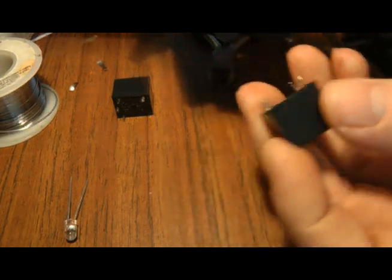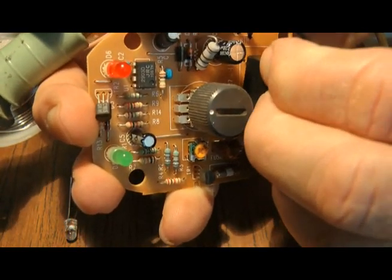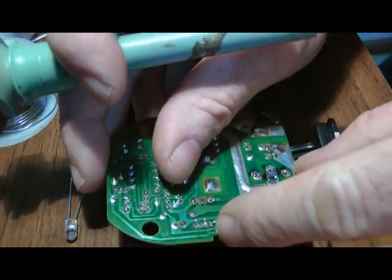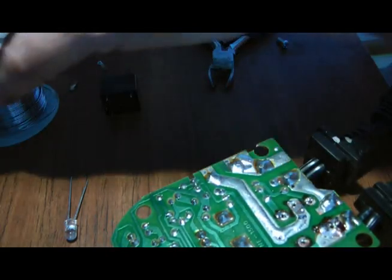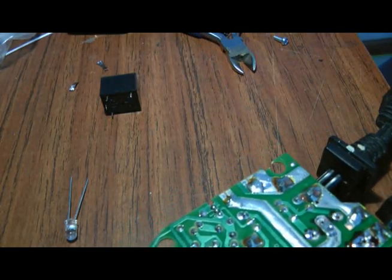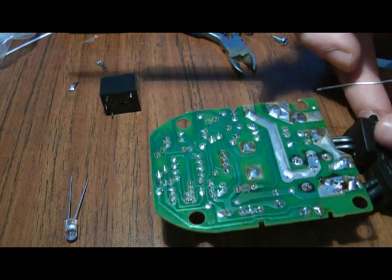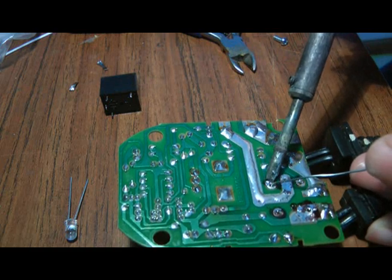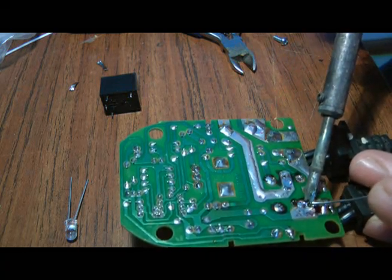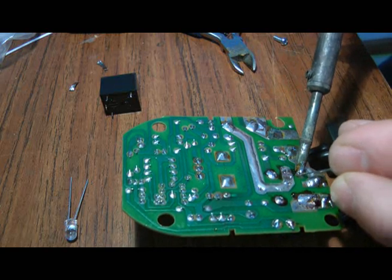If you're shopping for one of these, on the notes underneath the video on YouTube I'll put suppliers and as many relays as I can find that will fit in this, because it's kind of a pain to actually go through and measure and make sure they'll fit. But basically that's the big constraint — it's not the power they can accept, it's the size. For this relay, it's got five pins. You just turn it back over — five holes, five pins, you just line it back up, stick it back in, line the pins up a little bit if they're bent. Now all the holes are filled with pins. So now we're going to take the solder — this is just normal 60-40 solder — just come in here and touch each place with some solder. Solder here, solder there.